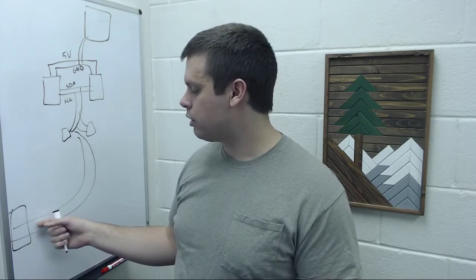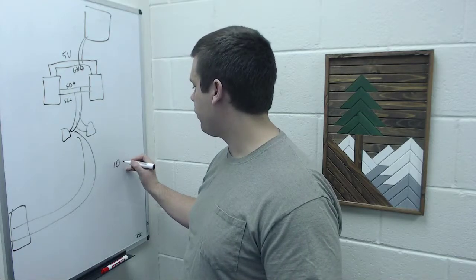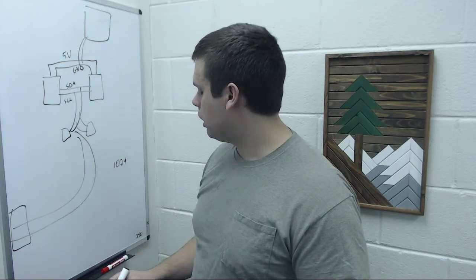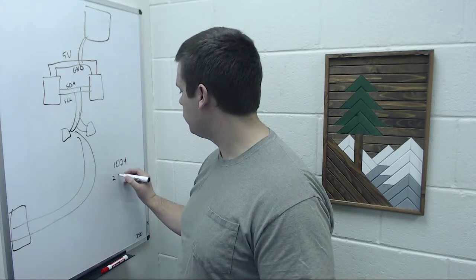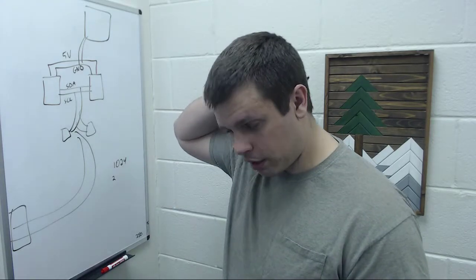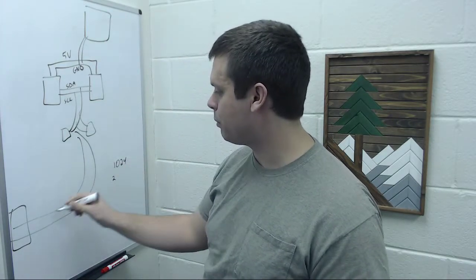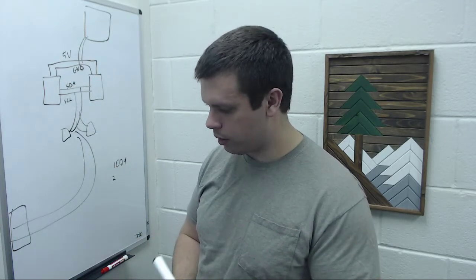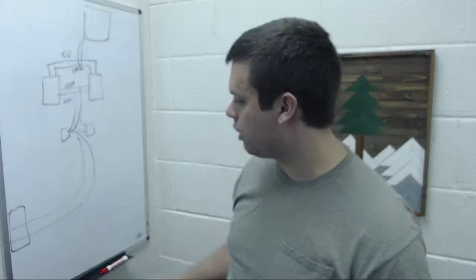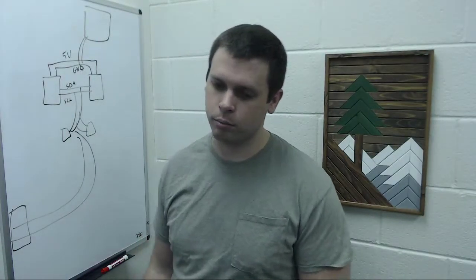let's see, you could do the position, which goes up to 1024. So that would be 2 bytes, right? 255, yeah, so you need 2 bytes to store that number. So you would have to send that back over and over again. And it always crashed. We'd always have problems. You'd always have to go in and reset the bus by just turning the power off, turning back on.